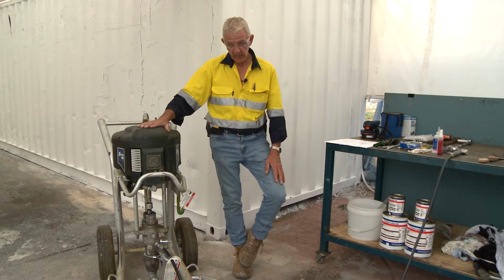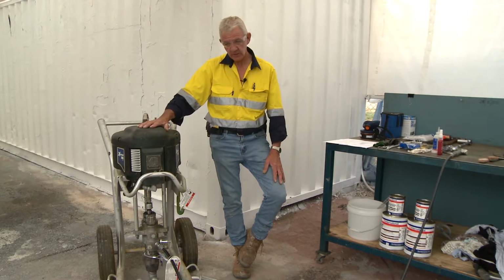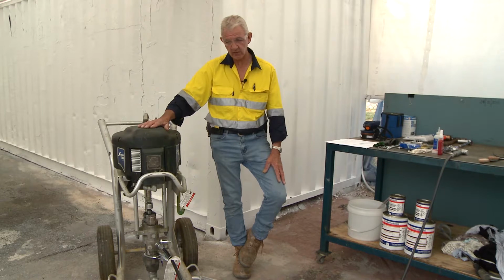Before we attempt to even utilise this piece of equipment, we have to make sure that one, we have air, and two, the pump is functional. So primarily before we even start, we'll go to the compressor, make sure we have fuel, the air cleaners are clean, the compressor is level, and the battery is charged. Once we start the compressor, we know that that's functional, and we make sure that it is working before we even attempt to utilise the piece of equipment, because we need the air.